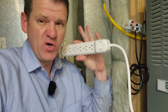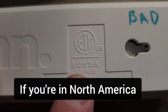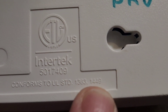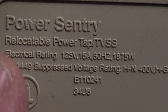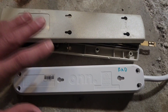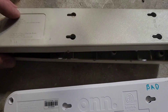If you want to buy one of these, you may be wondering which one is probably the best. You can get really expensive surge protectors, but where you want to start is making sure it conforms to the UL1449 standard. If you look at the back of this surge protector, you can see it conforms to UL1449 — and this one that protected me also conforms to UL1449. However, not all of these are created equal, because this Power Sentry power strip sacrificed itself and shut off power to my devices. Good job, Power Sentry.